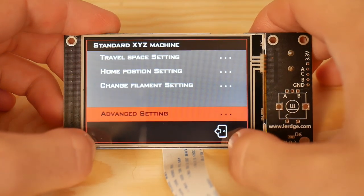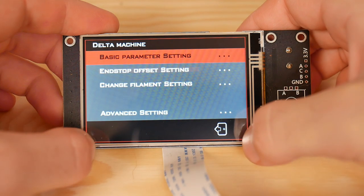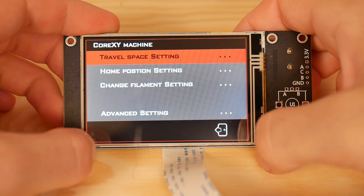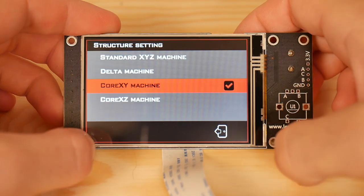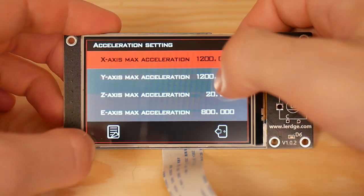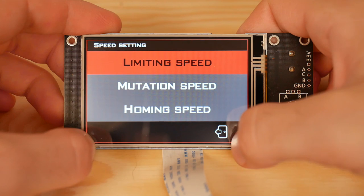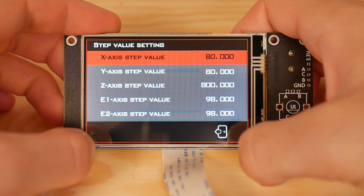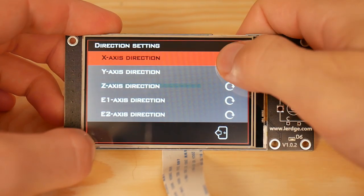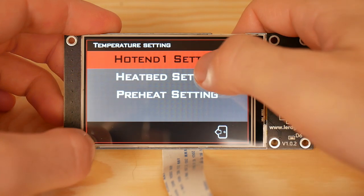As far as the overall look, I think it looks awesome — it's incredibly bright and overall pretty responsive to finger touch. Some of the cheaper LCD screens feel like the buttons don't work very well, but on this one it's really pretty good. It's got standard XYZ cartesian style settings, delta settings, and Core XY settings built in. You can adjust all your settings like acceleration, jerk, step value, homing direction — literally all the fine details. You can invert step motors, set the min and max of your 3D printer, and choose whether it has auto bed leveling or not.